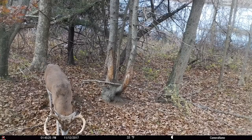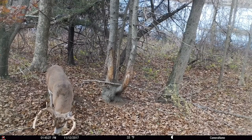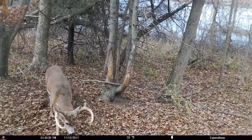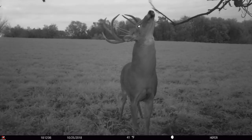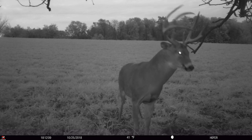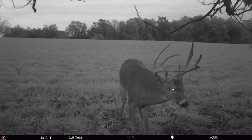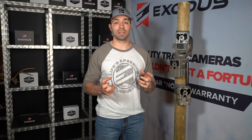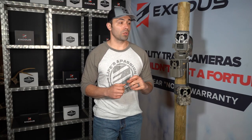There's a little piece of hardware that actually reads the available light in the environment and tells the camera: hey, there's enough light to take a daytime photo, I don't need a flash, I'm going to take a regular photo. Or it tells it: hey, it's dusk, there's enough light to take a photo but it's getting low. Typically these are going to be your transition periods where you have those grayscale photos, usually in the morning and usually in the evening — what we call transition photos.